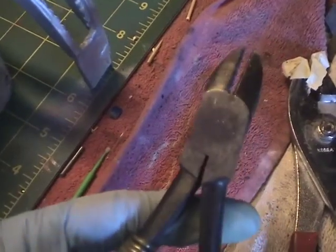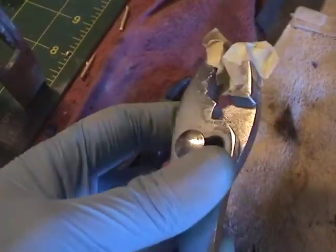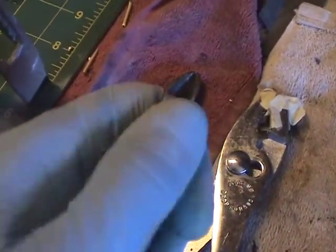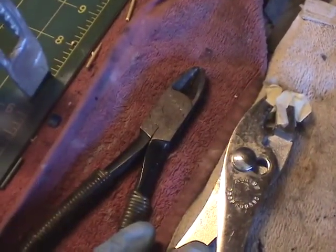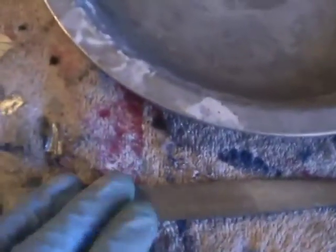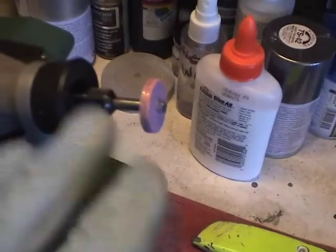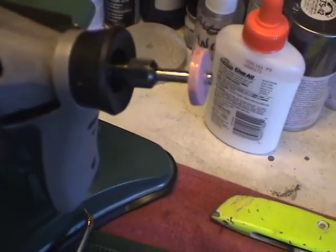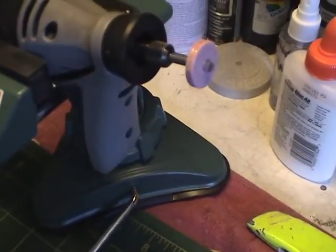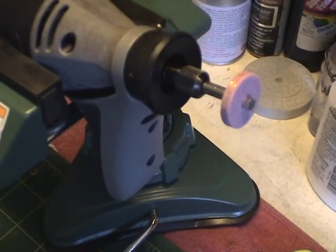To cut the rods it's very simple. I have these pliers here, and the brass rod is soft enough that you can snap it with the pliers. If you don't snap it completely, you can use a second pair of pliers — which I've insulated with tape so I don't scratch the rod — and just tweak and bend it until it breaks off. After it's loose, I come over to the grinding wheel and flatten that edge, then finish it off with a file. I have some water handy because the rod heats up as you're grinding. Remember to wear safety glasses when grinding anything, since things can fly at high velocity.